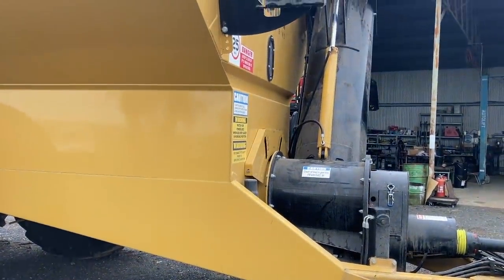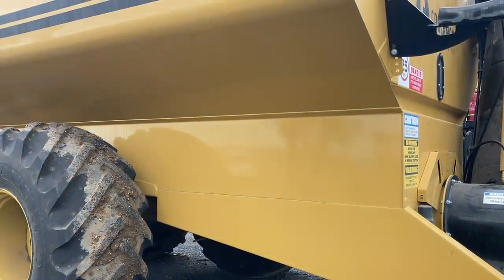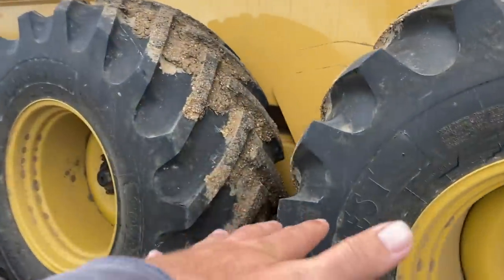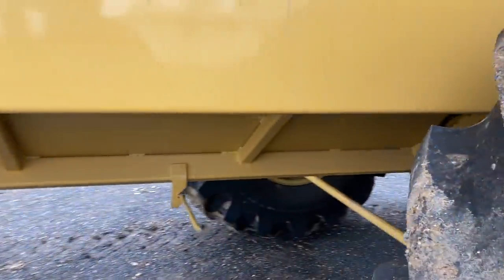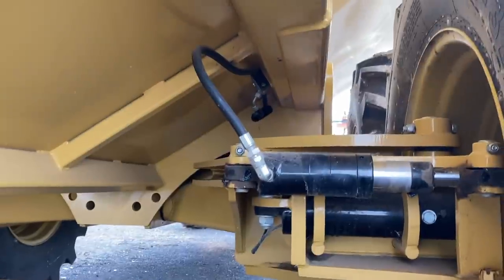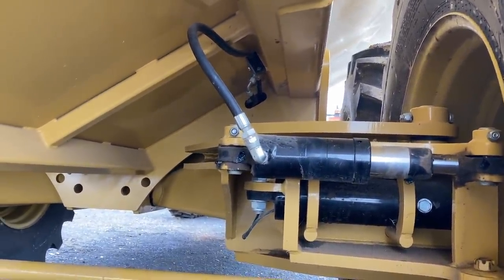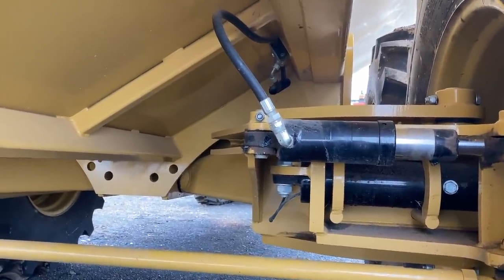Other than that, it's been really good. They've built it like a brick dunny, these things — very solid. It's got the full walking axle here, and it's got the steering. It's just a hydraulic controlled steering, so that's just for locking it and unlocking it. If you're backing up, you obviously want to lock it so it doesn't steer, but it's all automatic. It'll just follow, and that means it's not screwing around in the paddock as much.